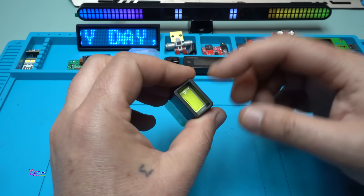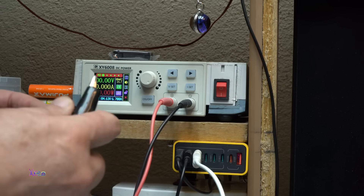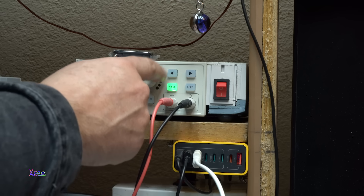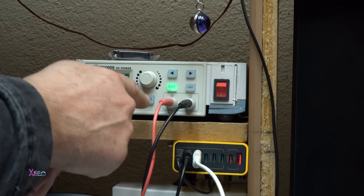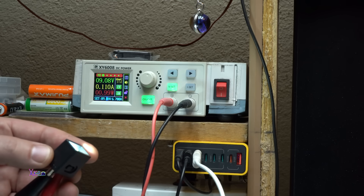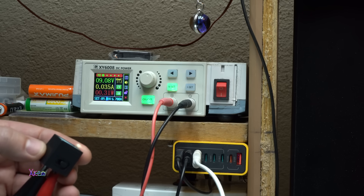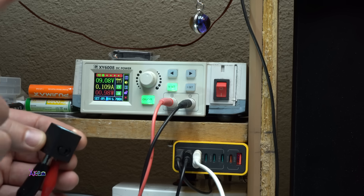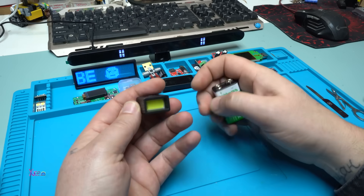Now I'm going to hook it up to my power supply to see how many watts the chip is. On my DIY power supply I'll attach the mini flashlight and set the voltage to nine volts. We have nine volts — hitting on. This is high beam I think and it's pulling 110 milliamps — one watt. At low beam it's 0.3 watts, 35 milliamps. High beam: 110 milliamps, one watt. That is not bad at all. I was thinking this thing was useless but no — it's a very quick flashlight using a 9-volt battery.